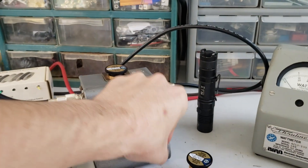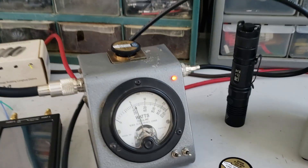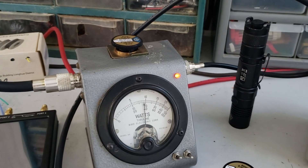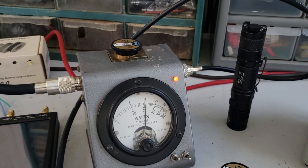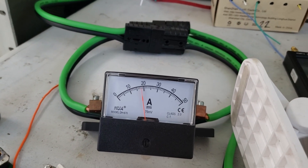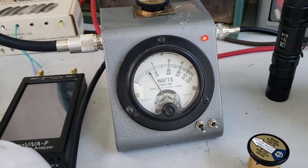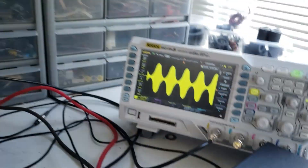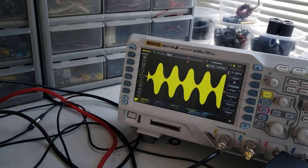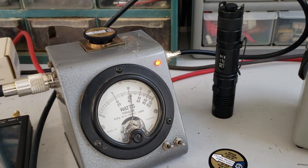Let's go into peak mode. So peak is around 2-something — let's crank that up. So that's about 400 peak watts. We're drawing about 18 amps, and it's giving us a little over 100 average watts, somewhere around 100 average watts. That's our waveform — 400 peak. Let's see how hard we can push it though.